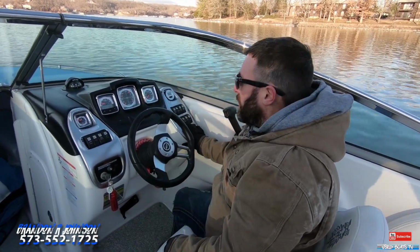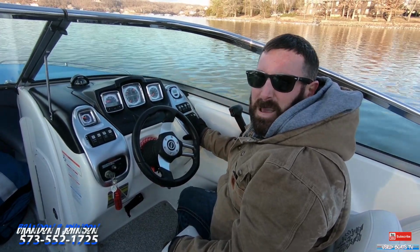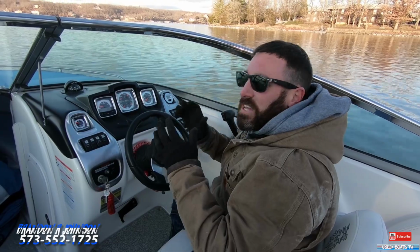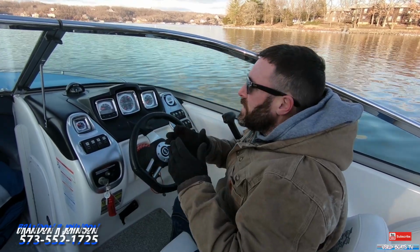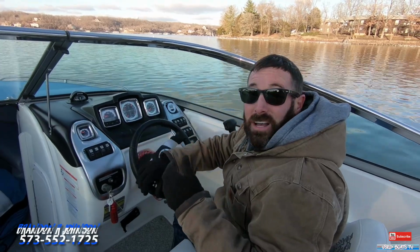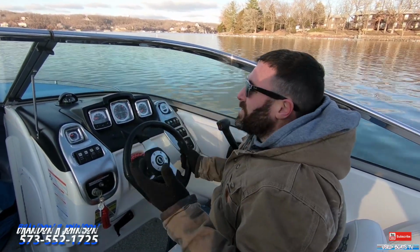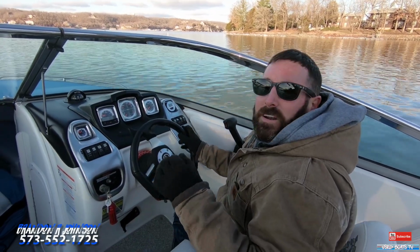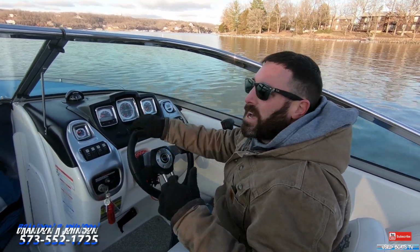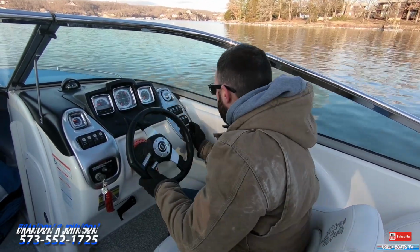Captain's call exhaust, okay? Off, now you can hear how quiet the boat is. Now you can hear how amazing it sounds. Only switch that at idle speed, okay? You're choosing how your boat pumps out the water, which it's pulling in to keep the engine cool, and your exhaust. So what turns the flappers in there that chooses what you do is a pencil, a little smaller diameter than a pencil. So maybe not the first time, maybe not the 10th time, but one of these times you will break those pencils that turn your flappers, okay?